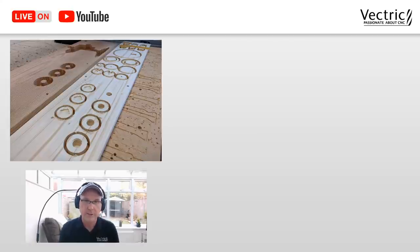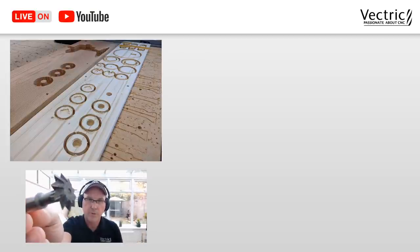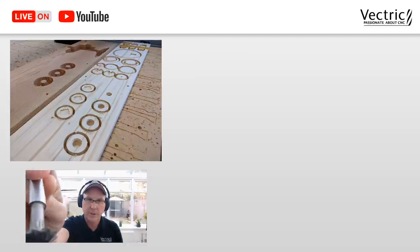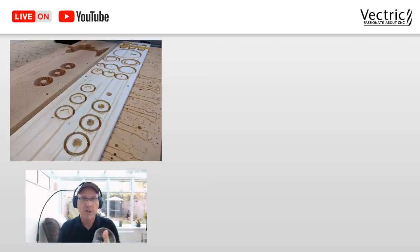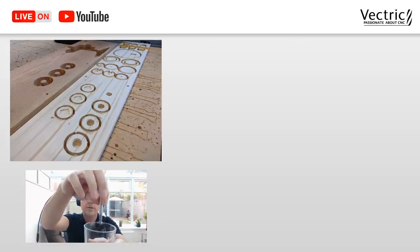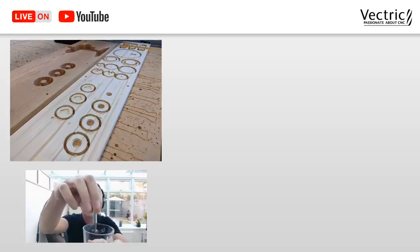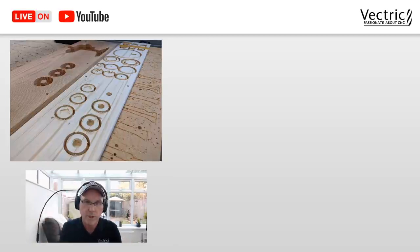So here's how it works. I've got my props here. You guys know I like props. I've got a glass and the thread milling tool. If you've never seen one before, it's right there. It's a pretty interesting looking thing. So the first thing you do is you pocket out a hole. Pretend this is my pocketed out hole. Your tool comes over, drops down into the pocket, and then goes around the edge of that and cuts in the threads. The threads are kind of outside of that pocket, in the sidewalls of your pocket, right? So down it goes to the bottom.